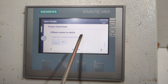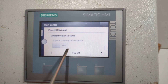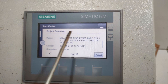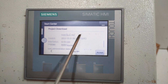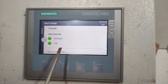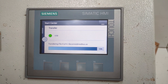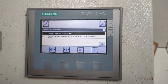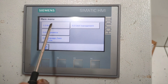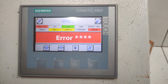You can check from here whether you want to upgrade the firmware or not. By default, for the first time you can select this option. However, since it is not the first time downloading to that HMI, the project file firmware and the HMI firmware are the same, so it will not differ and you cannot select the firmware version. Now I will accept to download the project.